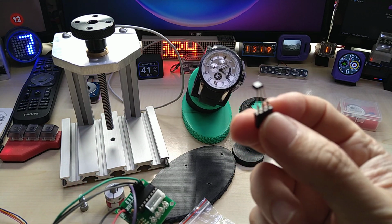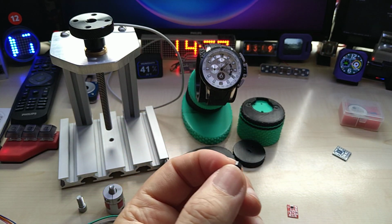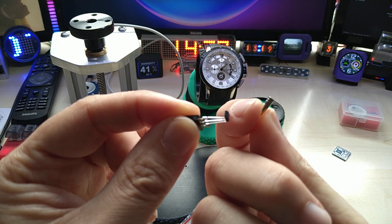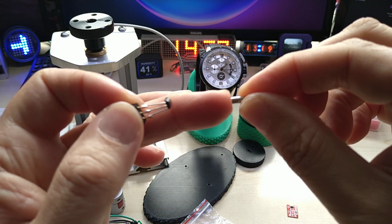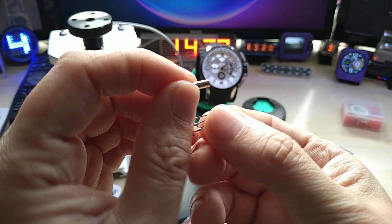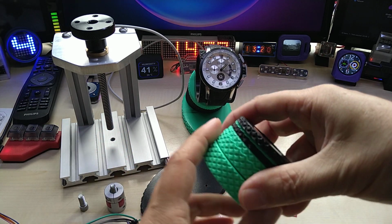And for those people who might not know or are interested in knowing, these sensors obviously use a magnet to detect it, but only one side of the magnet. And if you put it in the wrong way, it does not work. So if it's, say, the North Pole here, it works with the North Pole or with the South Pole from the bottom. And the reason I'm telling you this is because I made a mistake, and that's why all these trial versions are.